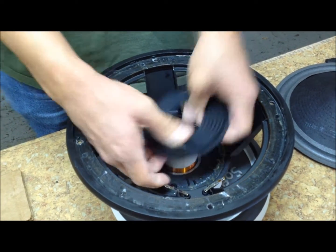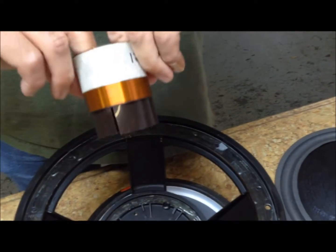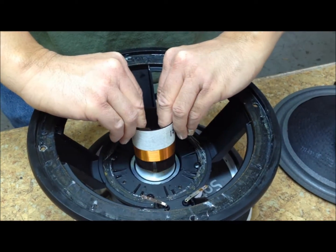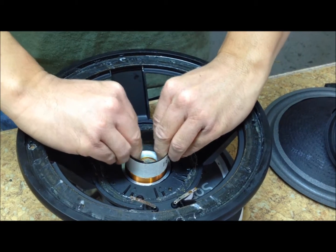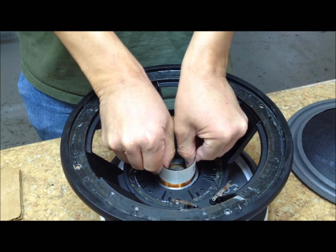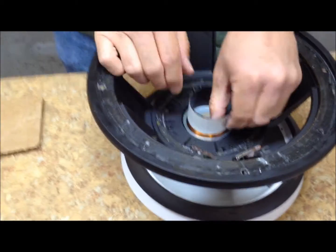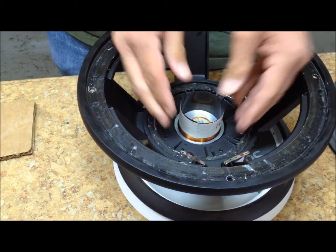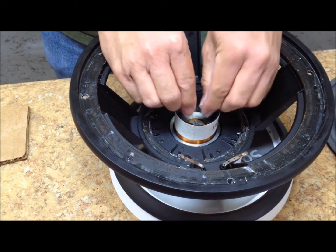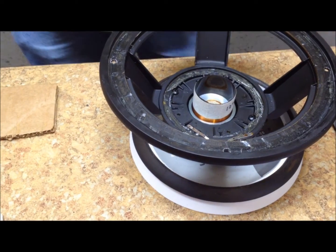Remove the parts, carefully pulling out the voice coil and shim together. You should set the height of the voice coil so that there is almost an even amount of space on the bottom of the shim to the windings. Set it so that the voice coil leads are pointing toward the terminal, and fold them over carefully so they won't get in the way.